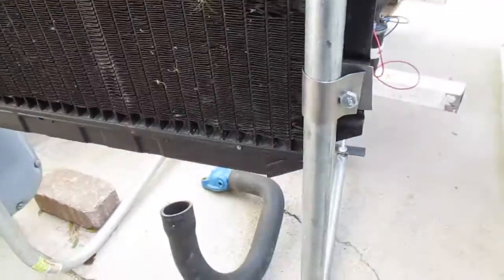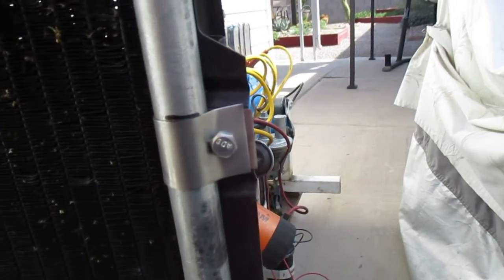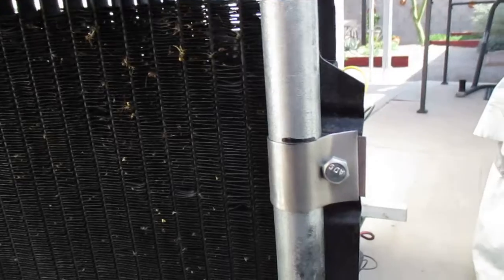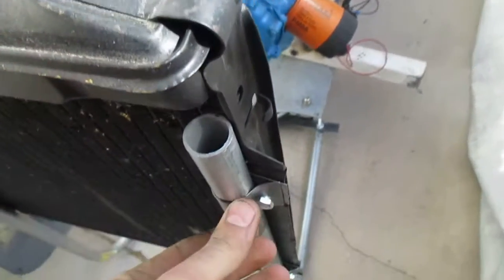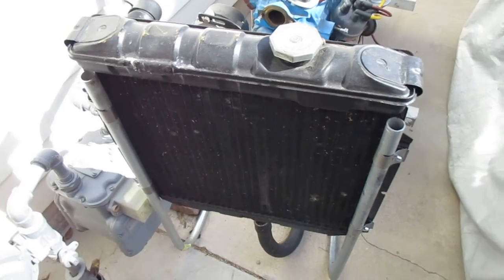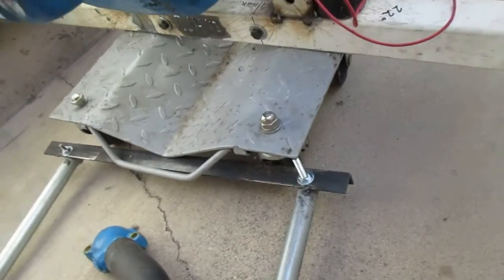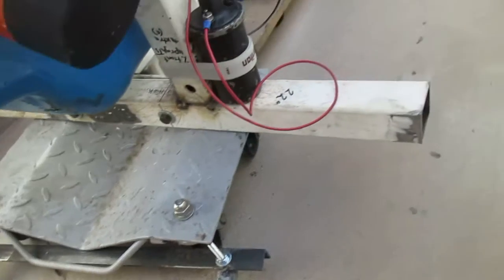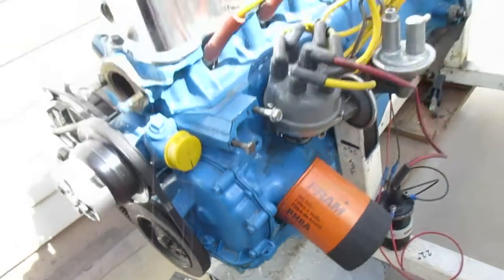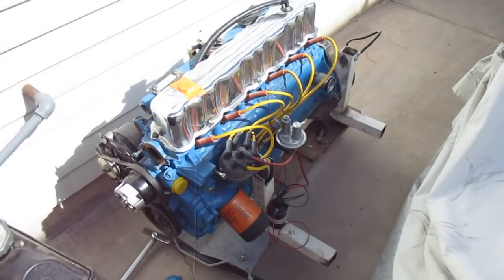That's just some electrical conduit, and I made these little sheet metal clamps — strips of sheet metal that wrap around the conduit and bolt in, so when you tighten it, it tightens up around the conduit so it doesn't slip. It's kind of adjustable. Then that just goes to a piece of angle iron that bolts onto the front brace here, and that's my homemade test stand.